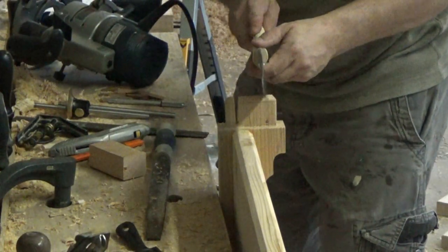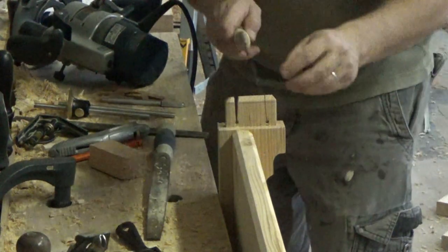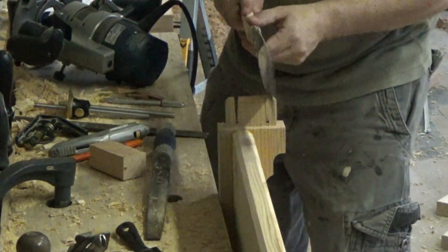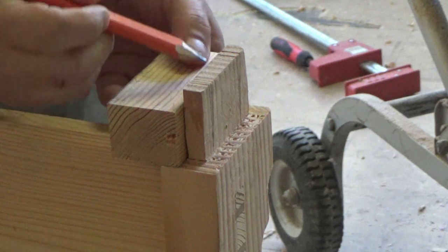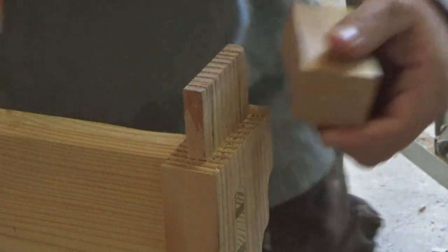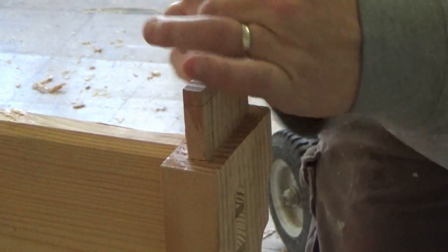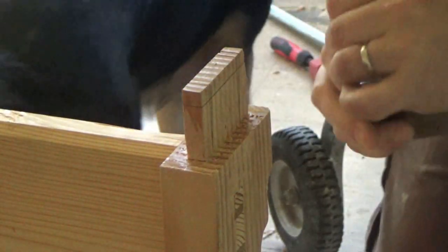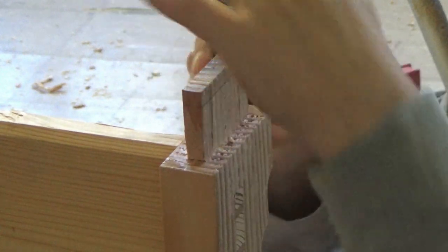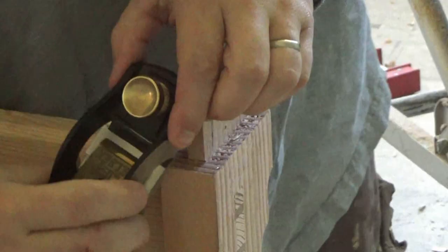These are the assembled shelves. I did the same wedging approach for the rails going into the front and back legs, but for these I did pre-chamfer the tenons that come through — and here's how I did that. That's actually a scrap from the leg cutoffs, so it's the exact same height as the legs. I intentionally used a thick pencil to give myself a little room so I didn't over-chamfer and end up recessed down into the mortise. I wanted to make sure the tenons were proud, so I traced the thick line and then approached it carefully, making sure I didn't go past it.